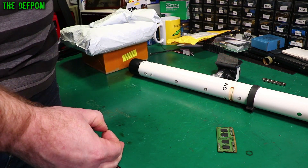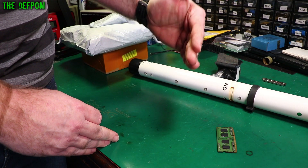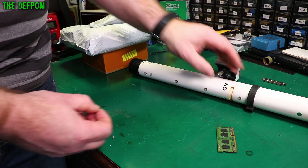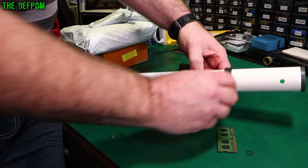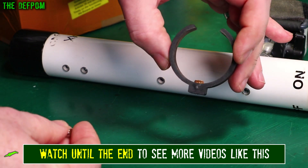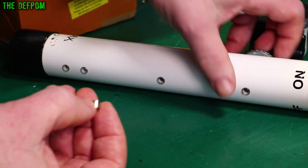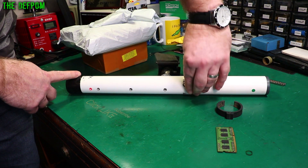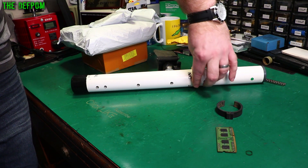I actually ordered the magnets about two months ago — they never arrived. New Zealand Post lost them. They left the airport and never arrived at the depot they were going to. So somehow they got lost between the airport and the depot — they just disappeared, and it still showed as left the airport. But the idea is the magnet goes in here, in this slot. So you mould around this. This one here has got the magnet inside — you can see it's all rusty and degraded because these are used outside. The idea is I'll get a new magnet and make a new piece. I've designed it and got a mould around this existing magnet. The magnet will then go into the slot here, come around, and as it comes around the slot it activates a switch — there's a reed switch in there, and the magnet turns it on and off.